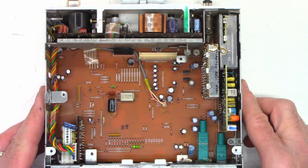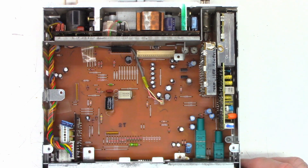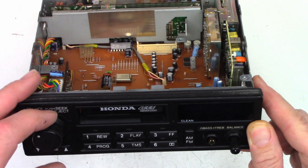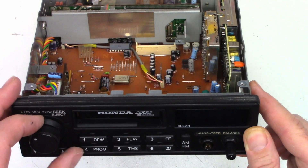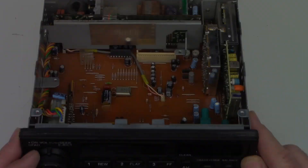Let's go ahead and try to power this thing up again with no tape mechanism. And I'm back down to 0.00 amps. Let's power this thing on. I'm up to 1.14 amps right now and I've got no display without the tape mechanism in place. No sound. Still goes into current limiting though. If I turn the fader to the right channel it's definitely going into current limiting — 10.4 volts at 1.98 amps. That's not right.